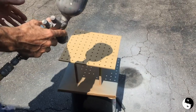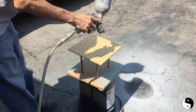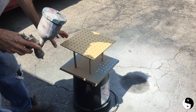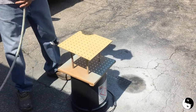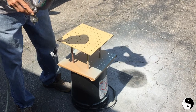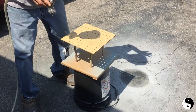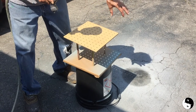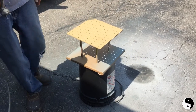Typically you give a piece two passes when spraying. Instead of doing both passes the same direction — where a dry spot might appear the same place twice — spray one direction then the opposite direction to fill in more evenly. If it's a piece of wood with grain running one way, do your first pass across the grain and your final pass with the grain. A dry spot running with the grain looks more natural; one running across the grain really stands out.